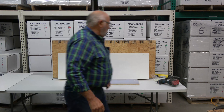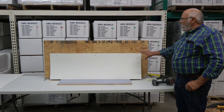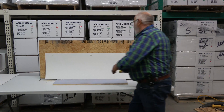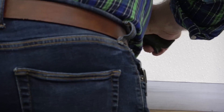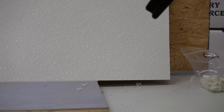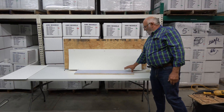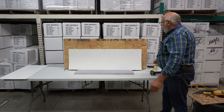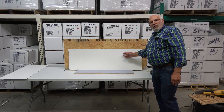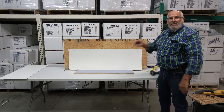Sometimes low-VOC takes some of the good ingredients out of a caulk, but in this case that's not so. Once the fasteners are in and we have pressure at the bottom, we simply run the same butyl caulk along the bottom edge. Concrete floors aren't level, so you adjust to your situation, but because we've put pressure on it we're usually able to just seal the bottom with butyl caulk. You've still allowed the wall to bleed water, and you haven't affected the warranty on the baseboard dewatering system.